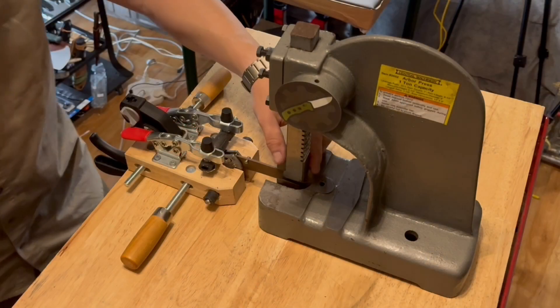Stick around, because thanks to my time-capsule, like-new-in-box model 710 circa 2011, we'll find out whether Benchmade's edges have gotten worse, stayed the same, or improved in the last 13 years. I will definitely resharpen the knife on my WorkSharp Precision Adjust Professional, because its plates have a slight radius toward the edge, allowing me to sharpen even more severe recurves on such blades. Stropping removed some of the burr, not all of it — but let's give it a shot. The blade is kind of biting in, but I cannot develop a continuous cut, so I will have to definitely resharpen it.